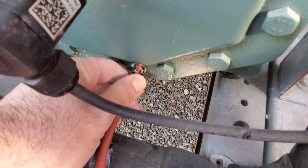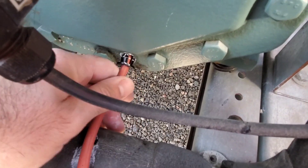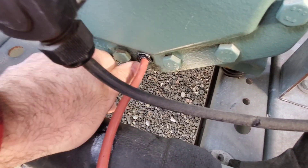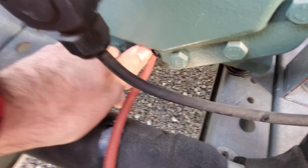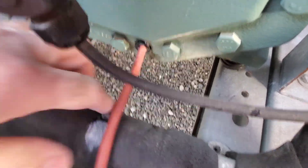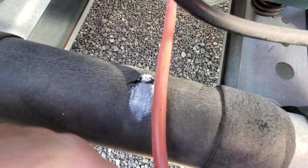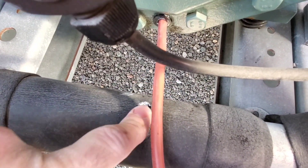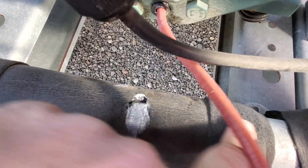We got the new one in place and it came with a new plastic clip — we're going to shove that in and use a rag to clean up the residual paste. The design here didn't help us out because the suction line goes right across and the crankcase heater came across and nicked the insulation, so we're going to have to repair that as well.